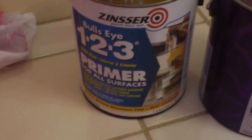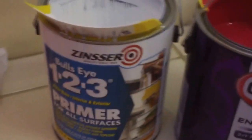So far so good — I'm pretty happy with the results. This primer is pretty good. It says it takes a full seven days to fully harden. So if you have the time and you're going to use this particular primer — though like I said there are probably better products out there — I suggest letting it harden for the full seven days before you topcoat it. I did not, and I think it's going to be okay, but I just want to get this room done. They're both latex-based paints so I think they'll be fine together.